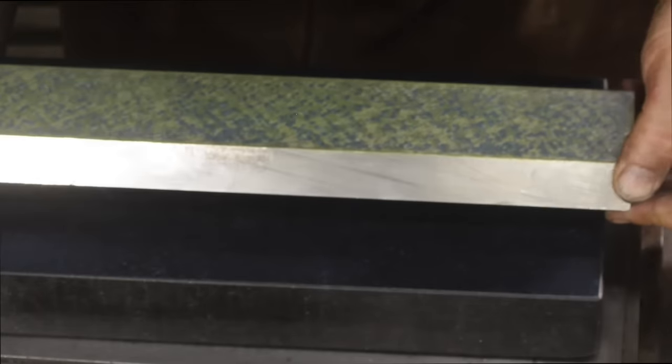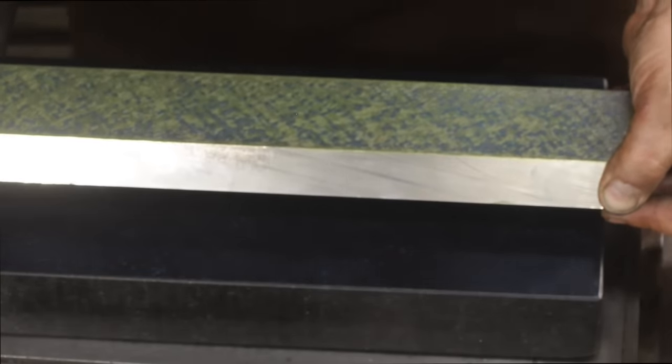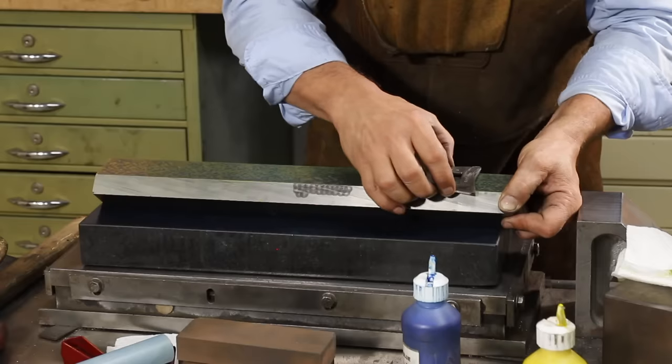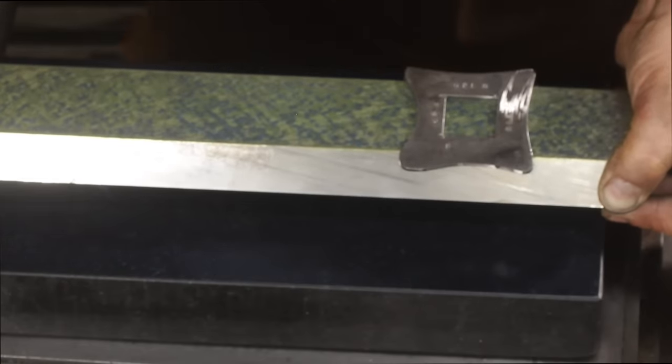So now you see this? See how that's set up? Now look at where all these high spots are. Anywhere there's blue, that's a high spot. You know, when I talked about dots per inch, we put this down, this 1-inch square, and we count up the dots. How many dots do we have?